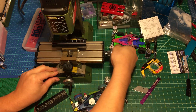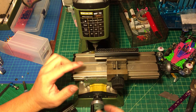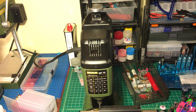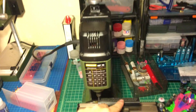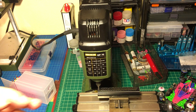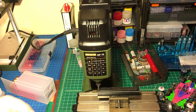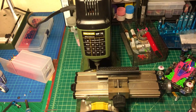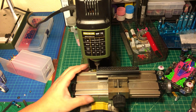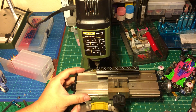We're going to start right here at the lowest point. Here's a tip before you cut: make sure when cutting from the lowest point you only cut a little bit. When you set up the height of the machine, only cut a little bit on the surface at the lowest point. Because if you cut too deep, by the time you get to the top point you're going to be losing a lot of material. This machine is really useful — I try to figure out many ways to modify my mini four-wheel drive. So here's what I do — I turn the machine on.